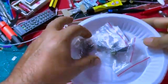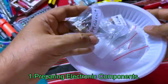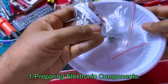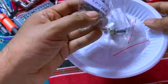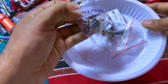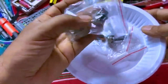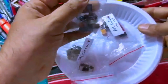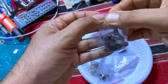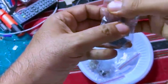Here's our radio packet, ready to be built. This is the FM circuit with the band selector and the variable capacitor, also the main IC2003. This is the audio amplifier. I'm not going to use this potentiometer — I'm going to use a smaller one, because our radio should be very small in size.